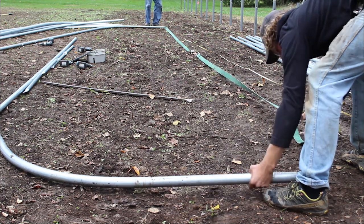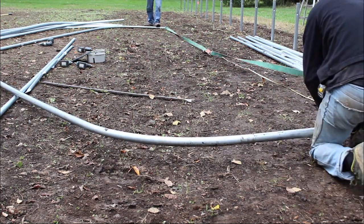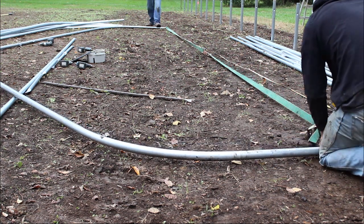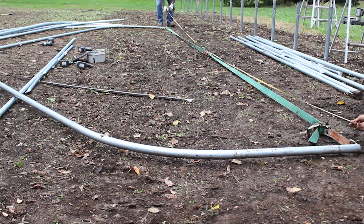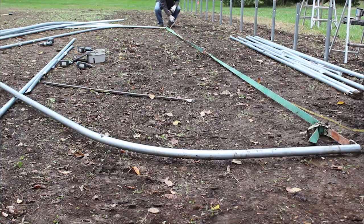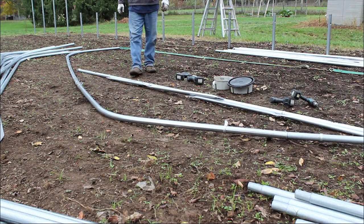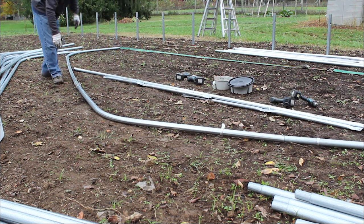to the appropriate width. So whatever your hoop width is supposed to be, 30 foot, 24 foot, or what have you, you're going to have to take some of the tension that's already on the hoops off of the hoops. So in this scenario, you can see we have ratchet straps set up. We're double checking the measurement, and it's a 30-foot wide hoop. Now that we've taken the tension off of the hoop, we're going to secure the trusses and truss supports.